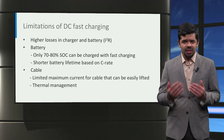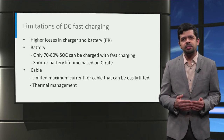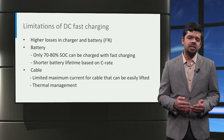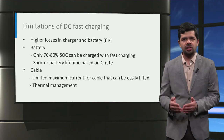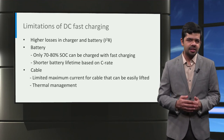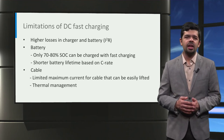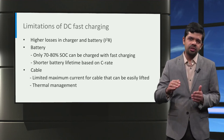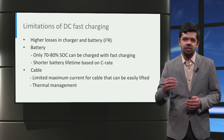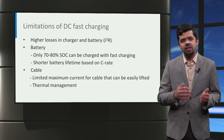The second limitation is coming from the battery itself. When fast charging a battery, the state of charge can only be taken up to 70 to 80%. This is because fast charging creates a lag between the voltage and state of charge, and this phenomenon increases as the battery is charged faster. Hence, fast charging is typically done in the constant current or CC region of the battery charging, and after that the charging power is reduced gradually in the constant voltage or CV charging region. Moreover, the battery's charging rate or C-rate increases with fast charging, and this leads to a reduction in battery lifetime.